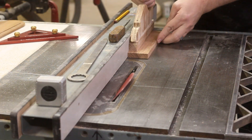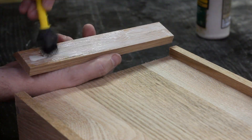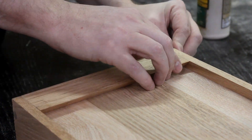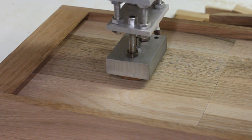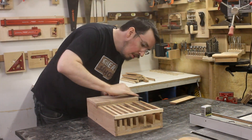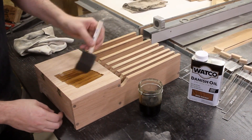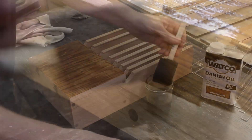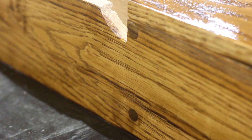This thing will probably have some weight to it once it's fully loaded, so I wanted a secure way to fix it to the wall. As you probably already guessed, I'll be hanging this with a hidden French cleat. I add my logo to the back, break all the sharp corners with a light sanding, and start applying finish. For that, I'm using a dark walnut danish oil. It's super easy to apply, you can't really screw it up — which is great for me — and it makes your shop smell wonderful.